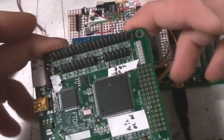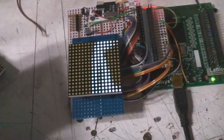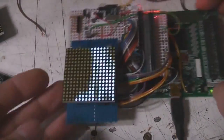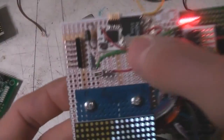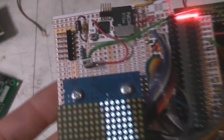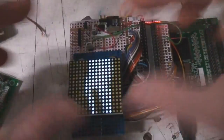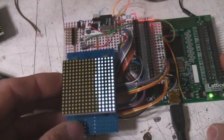Low-end FPGAs that haven't got tons of other stuff on the board, because a lot of it you're not going to use, just means they're nice and cheap, nice and simple, and you can just plug and go. So literally all I've done is wire this display straight to the pins. The data's just coming from a little board, a little PIC24 SD card player. For something that does standalone playback, the way to go would be to use SPI flash, because it's just so cheap these days.